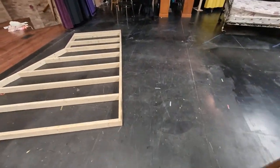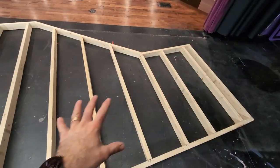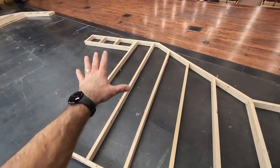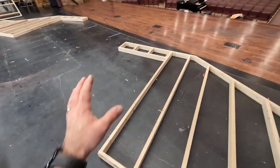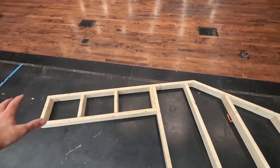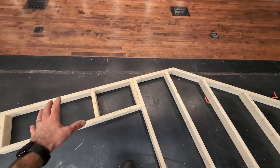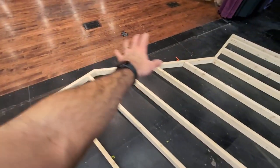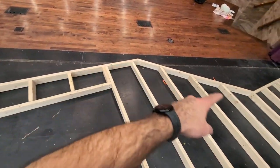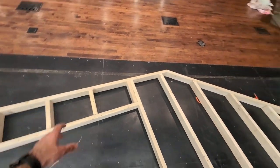There's a bunch of different things here that come into play, because if I really don't have trouble squaring something like this at this lower corner up there at the opening for the doorways, where you want things to be completely square. So by the time you get up there, if you're worried about the layout and you're putting big sheets on here and you have a little scrap of plywood necessary up here, you don't have the leverage necessarily to square this. Whereas if you had started there and the full sheet came down into this area, even though you notched it for the opening, all this reference surface here, when it's attached correctly, I can use that to force this where I want it to live.